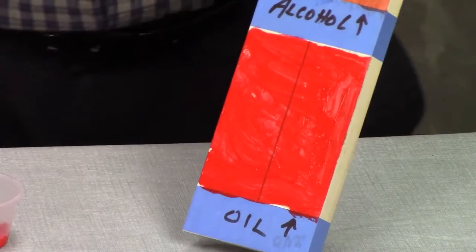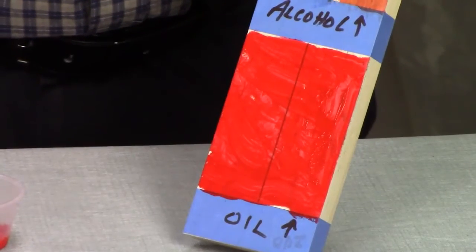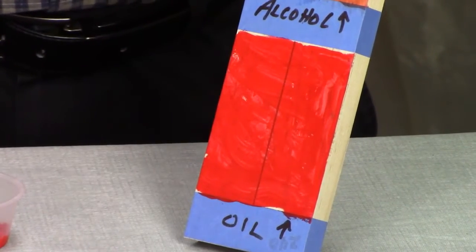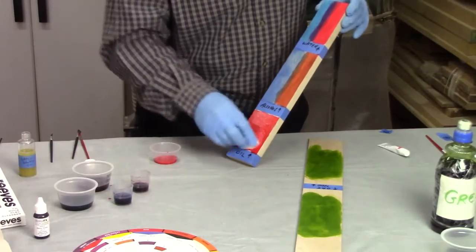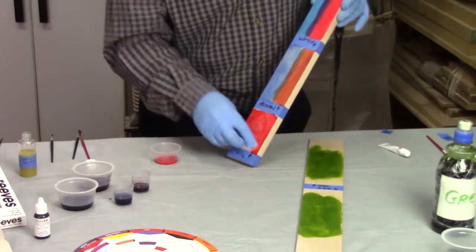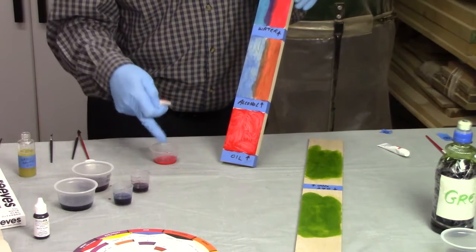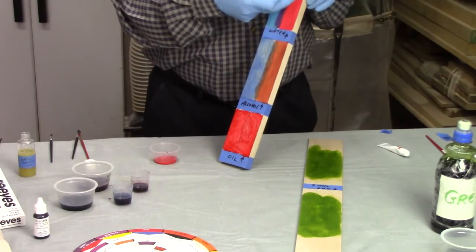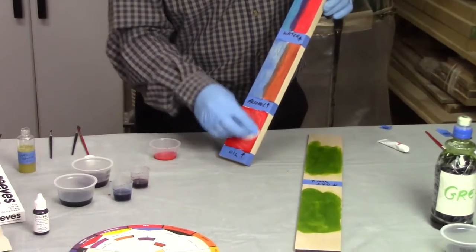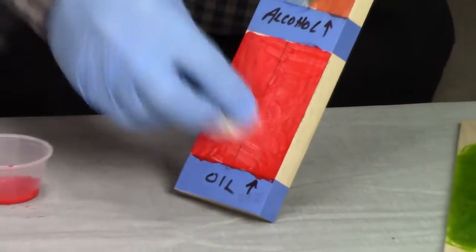I have found over time, if you use a piece of paper towel or a cloth, it will start to take the stain and the color will absorb into the cloth. Wax paper, piece of plastic bag would work just as well. And by doing that, you remember the grain in the artist oil, the pigment, the grain size would be bigger than what would have been in the aniline dye. So it needs to be pressed or rubbed some to get it into the wood.